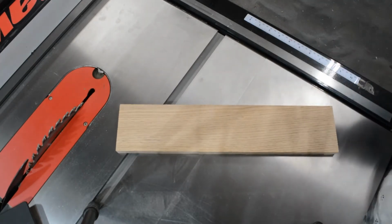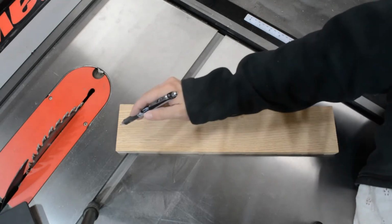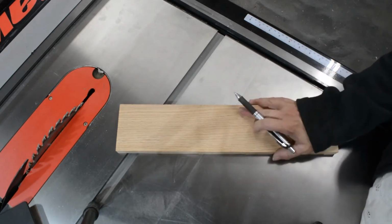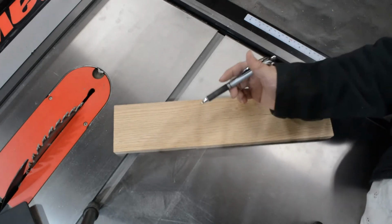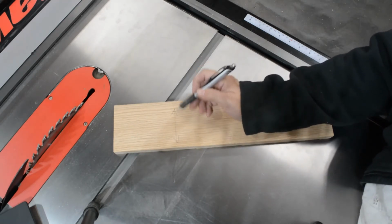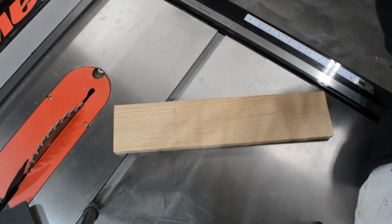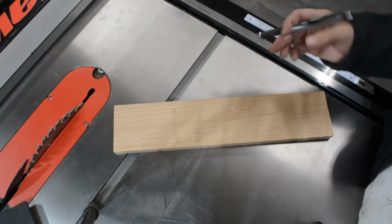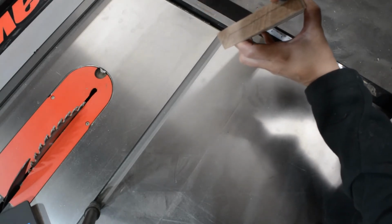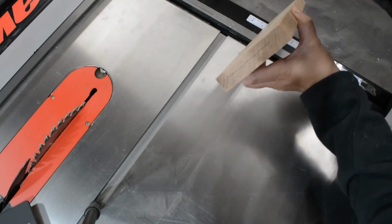So, all right, let's move on from there to the basics of how to actually cut some wood, shall we? All right, there are 3 main types of cuts that you're going to make in wood. The first one is a rip cut, and that is a cut that goes along the grain. The table saw excels at this type of cut. Now, a cross cut, by contrast, goes across the grain. These sorts of cuts can certainly be done on the table saw and are all the time, but there are additional safety measures that you'll want to take. Another type of cut is called a resaw, and that's where the board is cut parallel to the face. The table saw is limited in what it can do with this kind of cut.